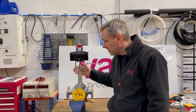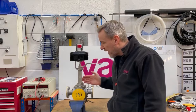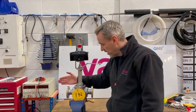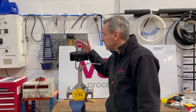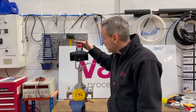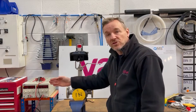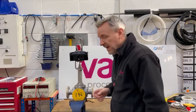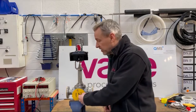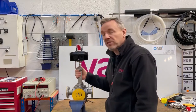In this particular instance, the customer wants flow to go in through port A and out through port B, or in through port C and out through port B. This beacon clearly indicates that when it's in this position he's got the flow coming in through port A and out through port B straight through the valve. Once he turns the valve, he's got flow coming in through port C and out through port B, and that can be seen here on the flow path indicator.